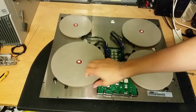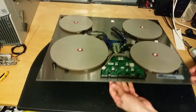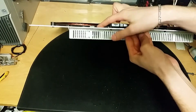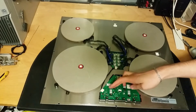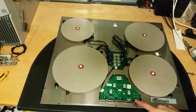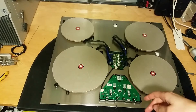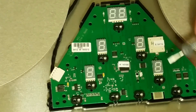Here we can see the inductors and the control board. Now we can see all the inductors - that one's pretty small, that one's pretty big, and they're all clipped together. This looks like two mica plates with the litz wire found in the middle. Here we can see the ferrite cores. The control board has some LED seven-segment displays, and these push buttons are actually photoelectric - the glass conducts infrared and detects when you put your finger on it.